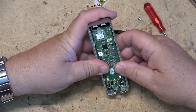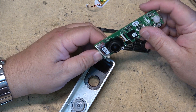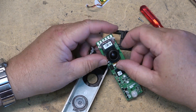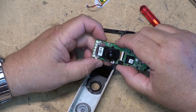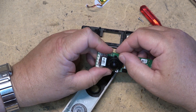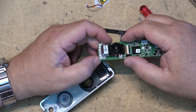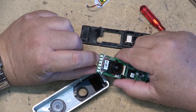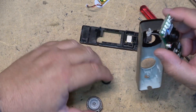Let's see what holds the rest of this in — I think it just slips out. Look at that, there it is. And what I'm thinking the problem with this camera is: there should be a mechanical infrared cut filter that is switched on and off, and I bet you this is it right here — and it's stuck in the night vision mode. As you can see, there's a series of infrared emitters at the top here that shine out through the top of the lens at night.